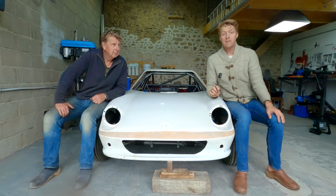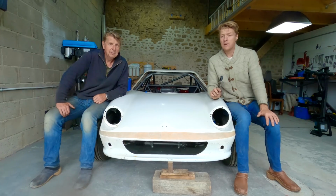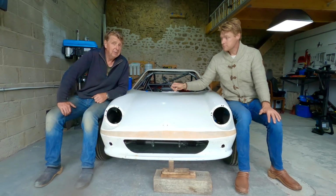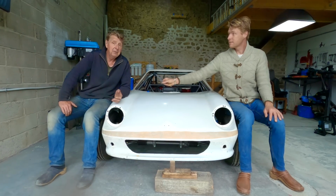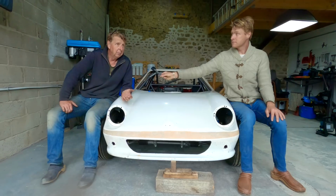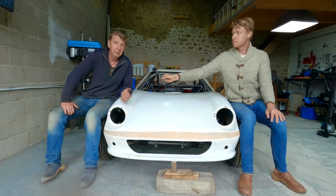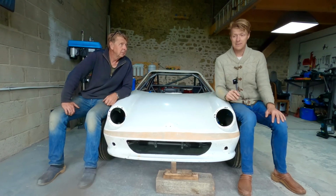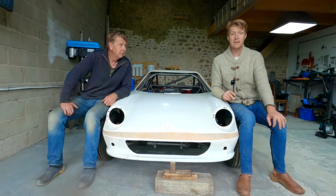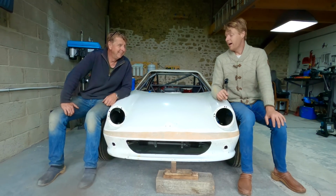Well, it might be a little bit of a shorter video, this one, but there was a lot of working out that went into it, wasn't there? Yeah, we've checked everything out. We've checked all the geometry. Everything's bang on as it was. The only difference is now we've actually got 40 mil of ground clearance under the diff at full compression. So everything is as it was in our drawings, basically, and it's all correct, which is superb.